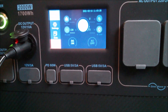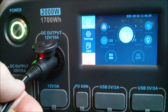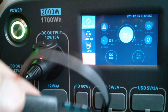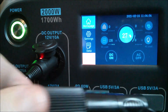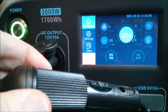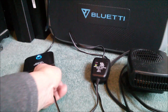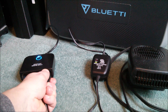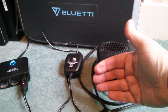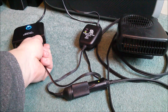Can you see the clock? Let's move in so that you can see the clock. Well that's interesting - this plug isn't getting hot at all, that's fine. But the wire's pretty warm. And this plug is now feeling really quite hot. Oh crikey - that fuse is red hot! So I've slightly rearranged it now. I've got my one-to-three way splitter here, this is my modified plug and that feels absolutely fine. As I say, this wire is quite warm but that plug doesn't feel like it's getting hot at all. And that fan heater is on and warm. Still got my dodgy braid fuse in there. I would say that's a success - this plug is staying cool.